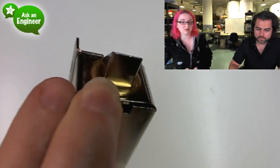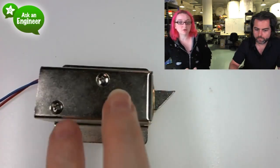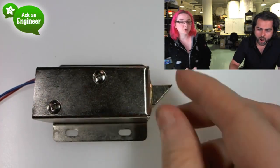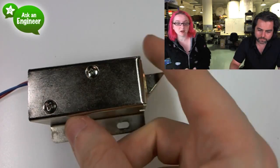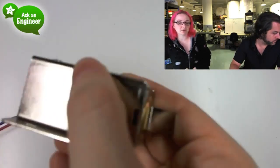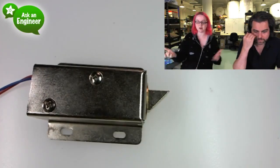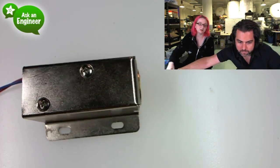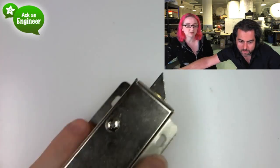These are actually used in safes and cabinets. If you undo these screws and you remove a little C-pin, you can twist this part around. See how the slant is this way? But depending on how you mount it, you may want the slant in any of the other 90-degree angles. So you can open it up and change it around — it just comes to us this way. Give it 12 volts, about 500 milliamps, and you can make your own lock. It has these nice big mounting tabs — really easy.